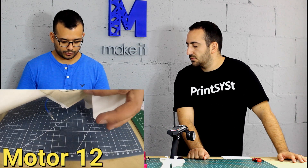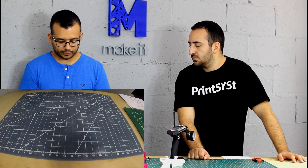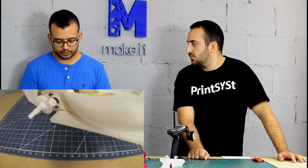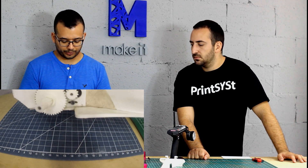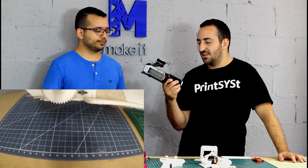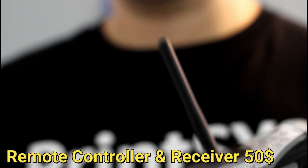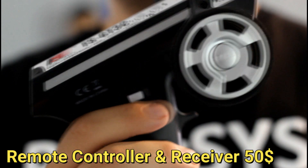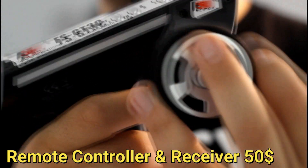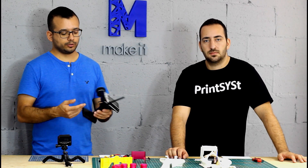Here's our fifth part, which is the motor. The only trick is to tighten the motor in place so that the gears are touching strongly enough that they won't strip, but not too hard so they deform and dislocate. The last part — the coolest and most expensive one — is the remote. It comes with the receiver and it's recommended on the website. You can use it for any project afterwards; it's a simple remote and you can change lots of settings, control the acceleration, change channels — it's a great product.